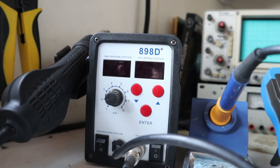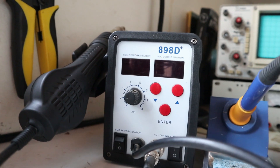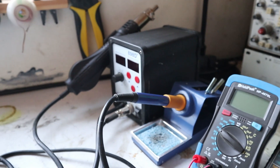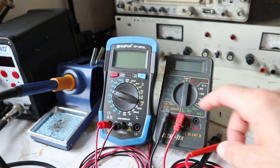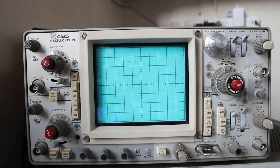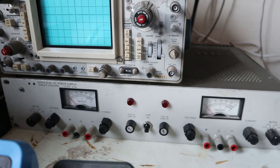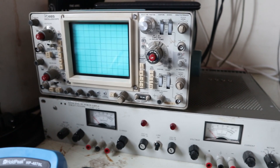The electronics equipment I'm using is a cheap SMD rework station from eBay or Amazon — I think I spent 50 bucks and it actually works pretty good. It's got the hot air on the left — that's not going to turn on since the power's out — and the temperature-controlled soldering iron on the right. There's an LCR meter here, just a basic cheap Amazon model, and your super fancy Harbor Freight free digital multimeter. I picked up an oscilloscope from a local guy on Craigslist — a Tektronix 465, kind of the staple of oscilloscopes. And I've got a nice HP power supply that a buddy gave me — voltage and amperage controlled DC power supply, 0 to 20 volts and 0 to 3 amps. That comes in pretty handy for powering various projects.